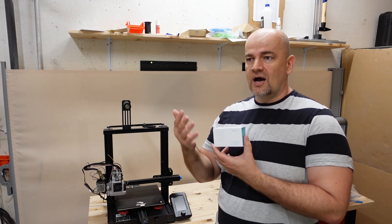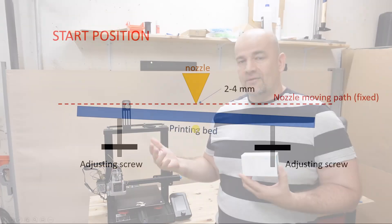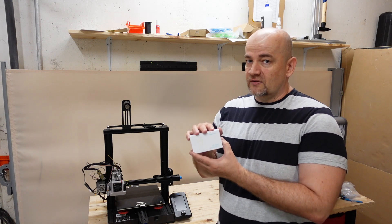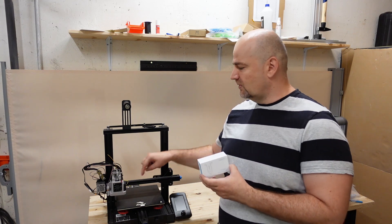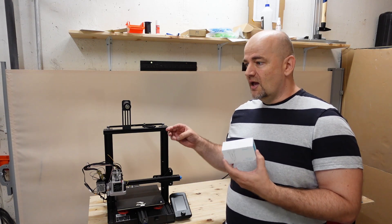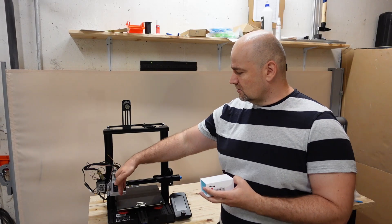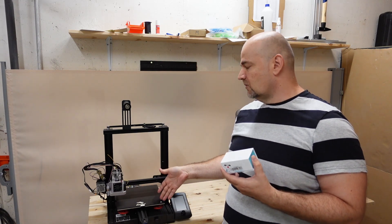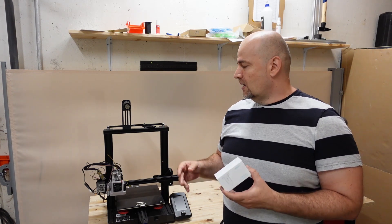Just a few words on how this touch sensor works. With manual bed leveling we rotate the knobs to make the printing surface parallel with the moving path of the nozzle. The CRTouch won't replace that, but it will compensate differences by touching different points on the printing surface and creating an offset mesh. It will know, for example, that on the left side it has to go 0.1mm lower, or on another corner a little bit higher, and it will compensate that difference during 3D printing.